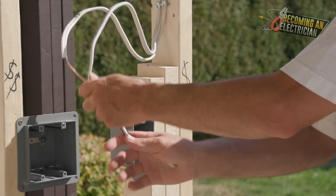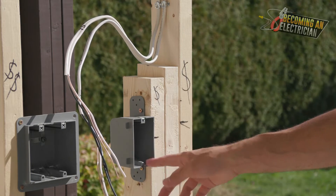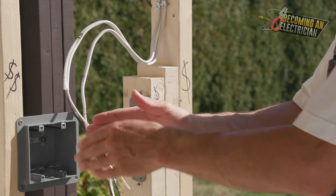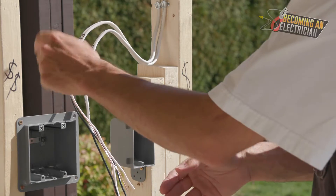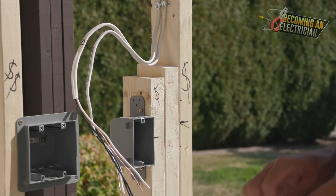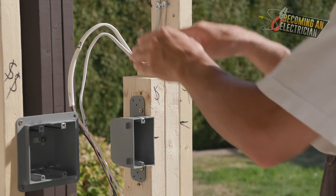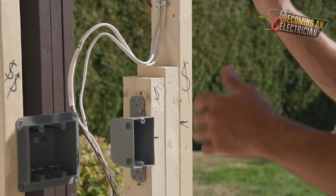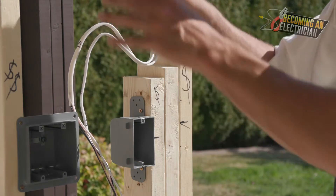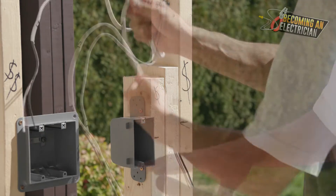When it comes to actually entering wires into the box, for a single gang it doesn't really matter too much - you just have a single device. But you can see we do have a double gang right here, and sometimes it's nice to have your switch leg or device one come into the first hole and device two into the other hole - we'll talk more about that in the next video on splicing. For a single device box, where you enter your wires isn't a big deal, but in bigger boxes it affects your overall finish.